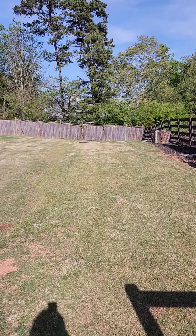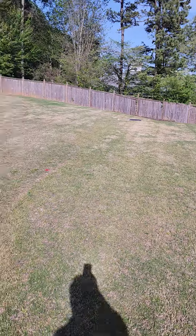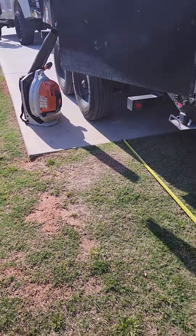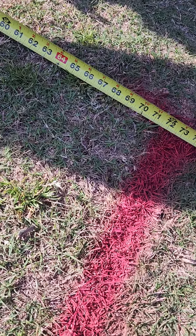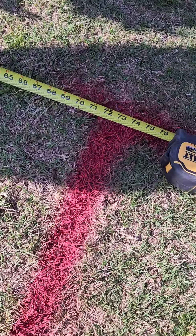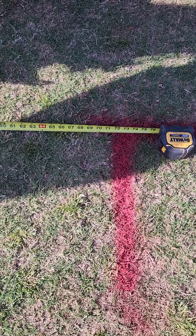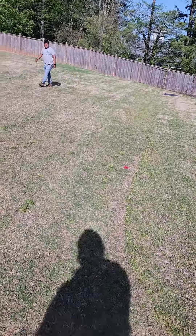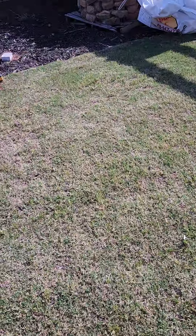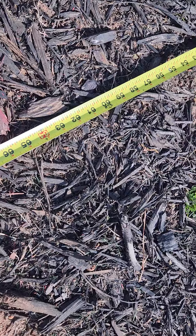This is the area for the batting cage, over here by the driveway. We're gonna be six feet, five feet six inches because up here in the corner is for the bowl, and then we have to have the timbers. We've got the marks for the timbers right here. We go 16 feet wide with the frame, and it goes right here to the corner.